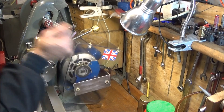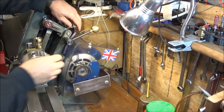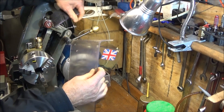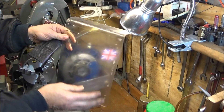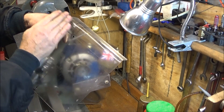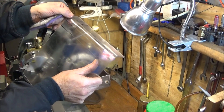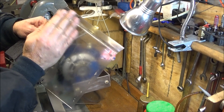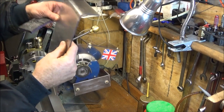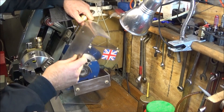The only other things you need are a piece of aluminium plate, a few screws, and a bit of foam rubber. The first part I made was a straightforward A4 piece of polycarbonate. I put it in a Black and Decker Workmate and heated it up with a gas torch — I did it a little bit too much in one spot, but that's not in view so I'm not worried about that. You can use a heat gun or a gas torch and bend it over until you get the angle that suits your lathe.